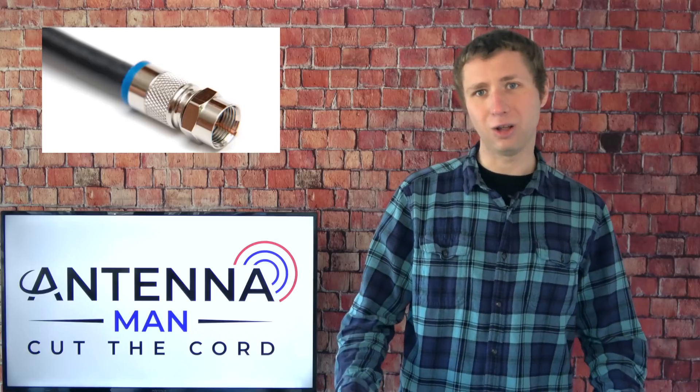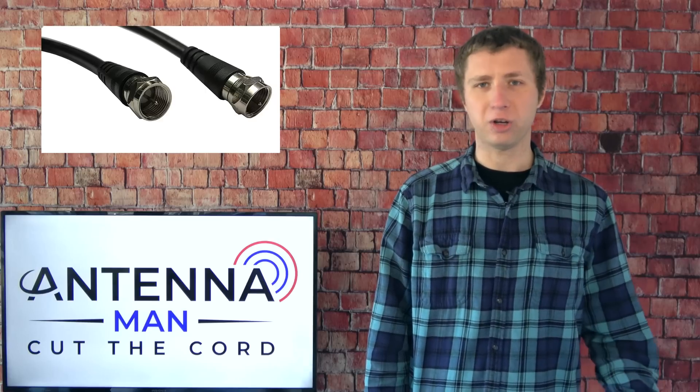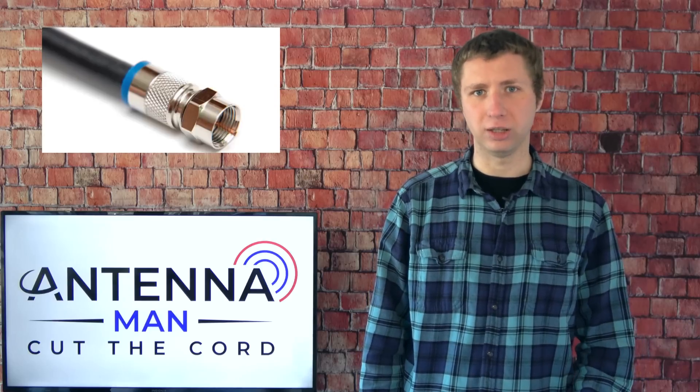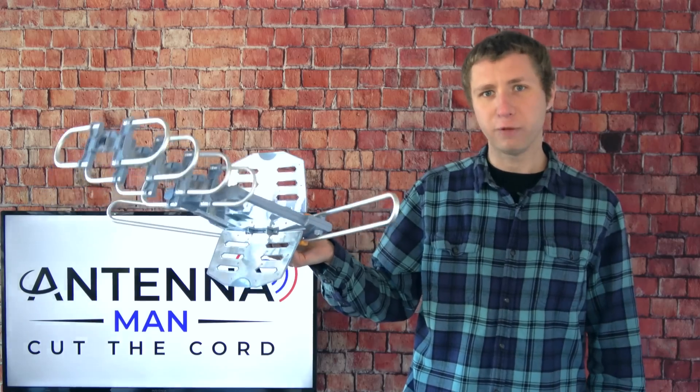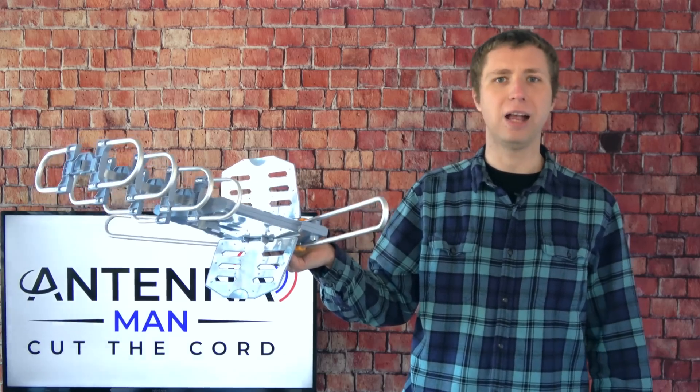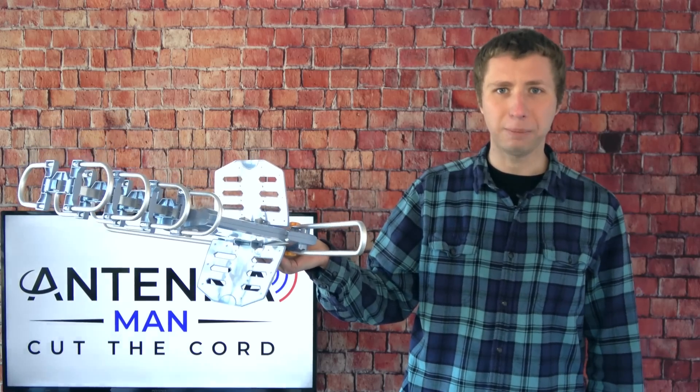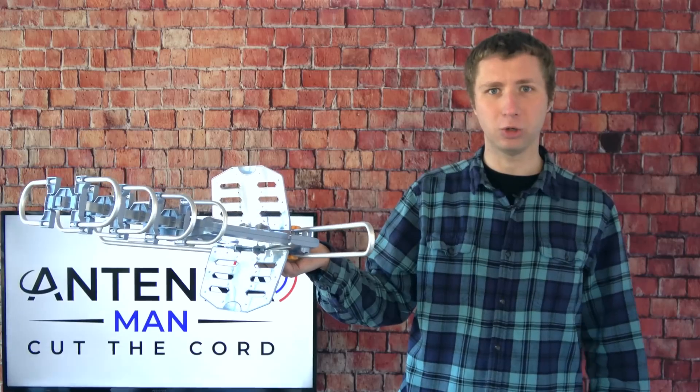What exactly is a long cable run? It really depends on many factors, including what kind of antenna you're using, and whether you're using a good quality cable or a cheap cable. A cheap RG-59 or junk cable that comes with a junk antenna is going to have more signal loss in a long run than a quality RG-6 or RG-11 cable. I should also mention if you have an antenna that already has a built-in amplifier, you can't just add another amplifier onto it, or it likely won't power the internal amplifier, and you'll lose all reception altogether.